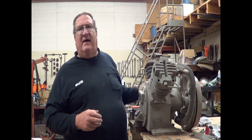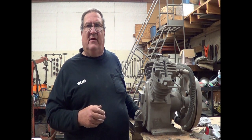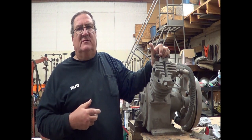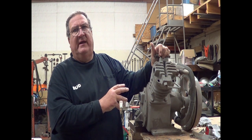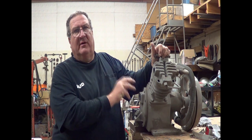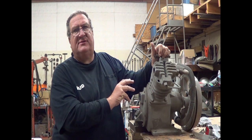The 24-75 was also electrically unloaded clear to the check valve instead of just the intercooler. These are your basic differences, but Ingersoll fortunately didn't stick with the 24-20 for very long. They went with this basic upgrade but refined it for your 24-75 that you use today.